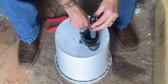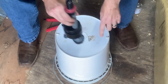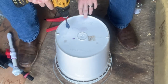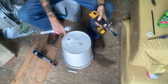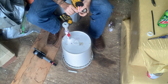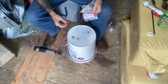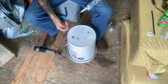You don't want to be too far over — if you put it right on the edge, the valve won't fit in there. So right up in here should be fine. For this piece, I just go across the way from it and I know that'll be fine too. So here's our three-quarter bit; we're going to go ahead and drill that right up in here. That needs to be just a little bit bigger than three-quarter — it's tight but it will go in. Then I'm going to change bits. Basically that fitting is going to go on the inside just like that. Now we're going to get that half-inch conduit nut and have our silicone ready.